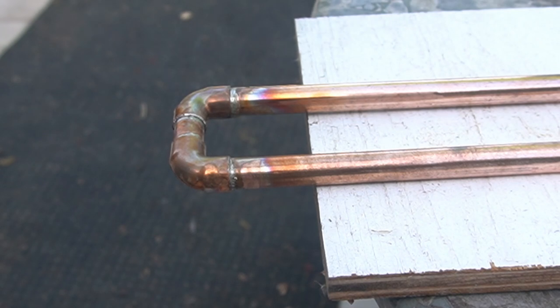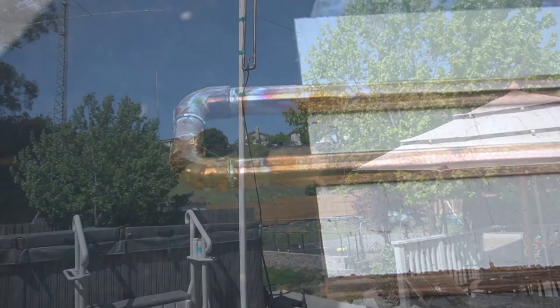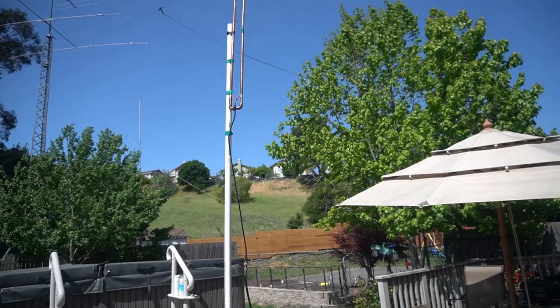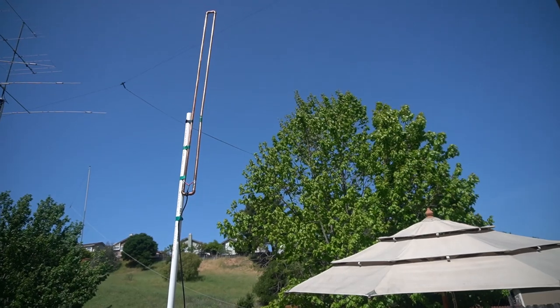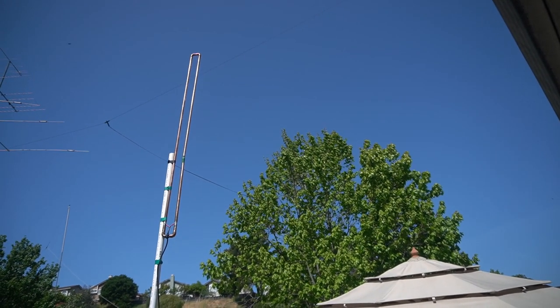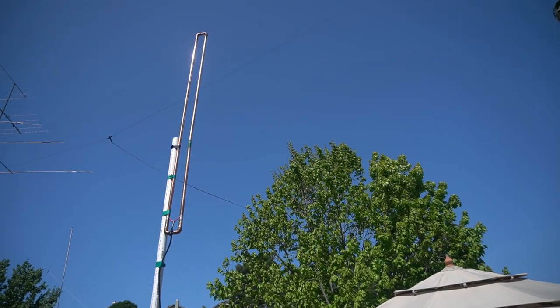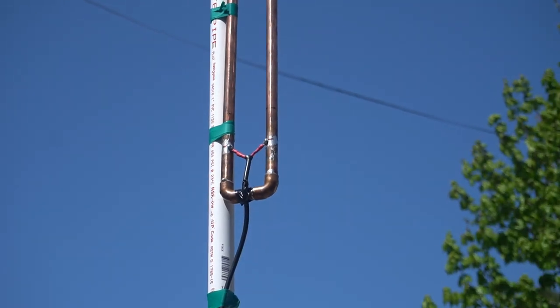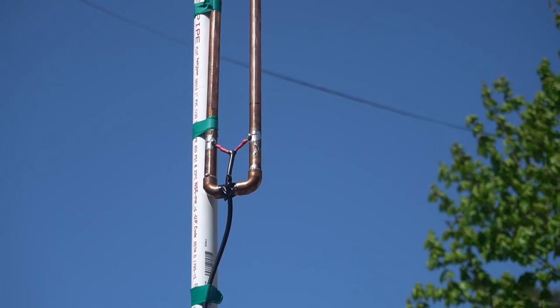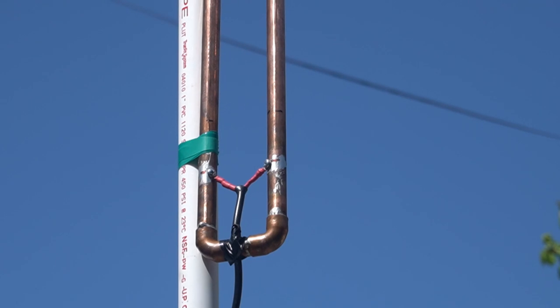Pretty much, that's it — that's all you have to do. I did put the little fiberglass piece in the middle; I may take it out and just put a cap on the ends. For testing, this is a pole — about a 10-foot pole. I'm setting it at about 8 feet at the bottom, and there's the top. I used some coax that already had ends on it, and that's what I used for my feed points. I got them just a little higher than I probably should have, but SWR is plenty good.